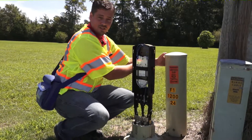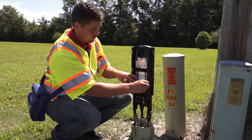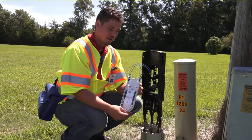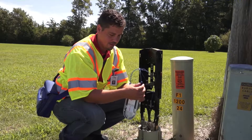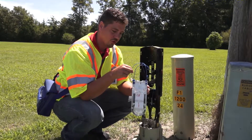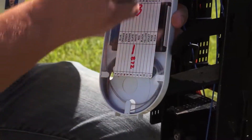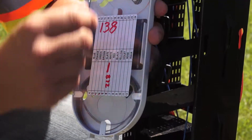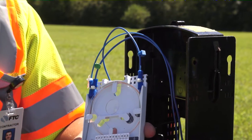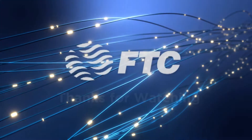This is a pedestal, and the cable that we just worked on — the main line down the road — feeds to here. We have marked different sides: the blue would be our office side and the green will be our field side. And then we have what's called a drop — this runs to the house and it's where we access the fiber in the tray. This particular house is fiber 138 and we write the fiber number and then the address in. This is where the house is connected to the main line system.